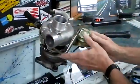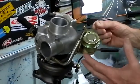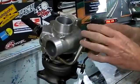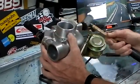So next, we removed the clip again and pulled off this aluminum housing. We inspected the land where the O-ring is — it was a very firm O-ring. Everything looked really good inside; there wasn't any damage to anything internally. So we took our dead blow and noted where on the housing the impeller was hitting.